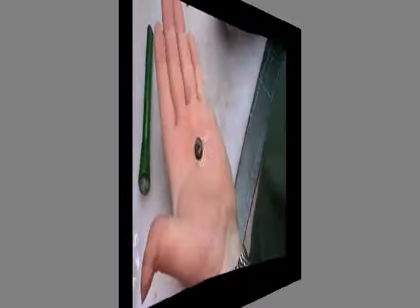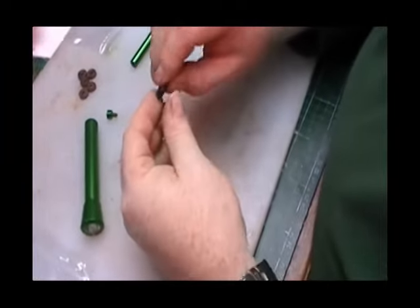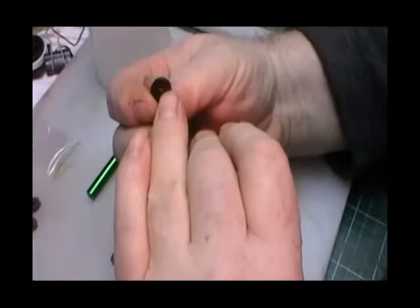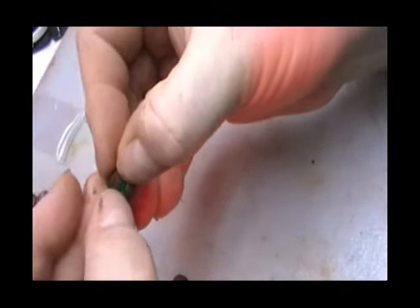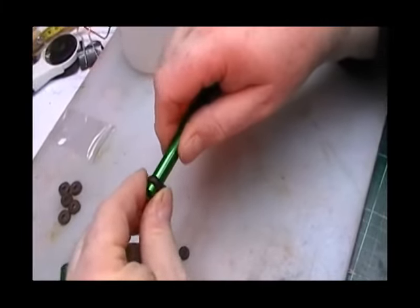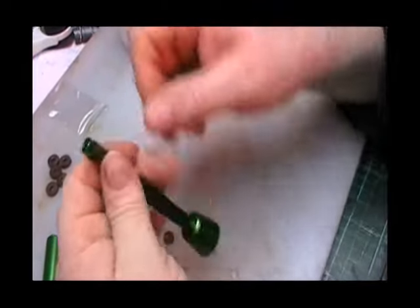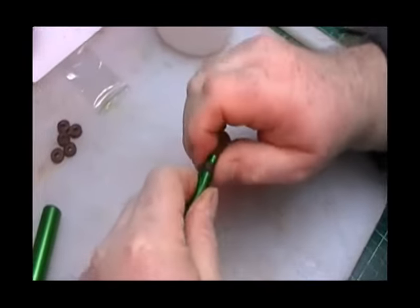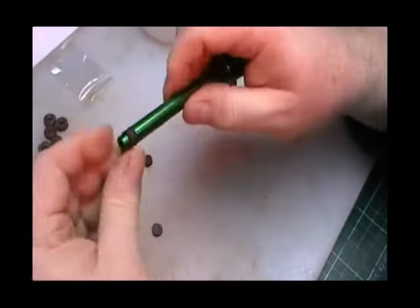It's about five minutes later and as you can see the leather grommet is nice and soft now. So what I want to do is pop that shiny surface in first onto the thread and then put the thread onto the piston. Now what we're going to do is squeeze it into shape like I'm showing you here and you see it flattens out. It squishes in to place.